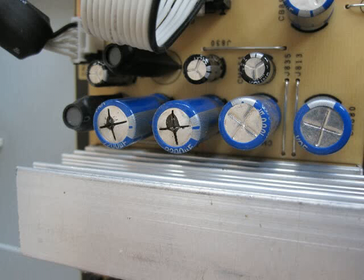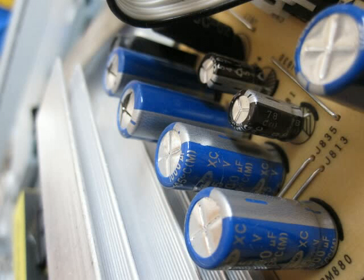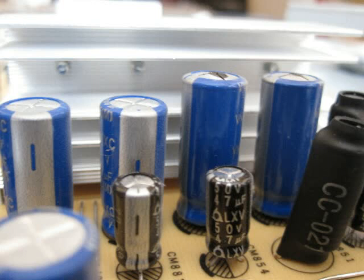Have a look here. You can see the two faulty capacitors next to the other two normal capacitors. The normal capacitors have flat tops and no black marks. At different angles you can see the bad capacitors are bulging on top — they definitely look rounded on top and have black marks showing they have leaked electrolytic fluid.